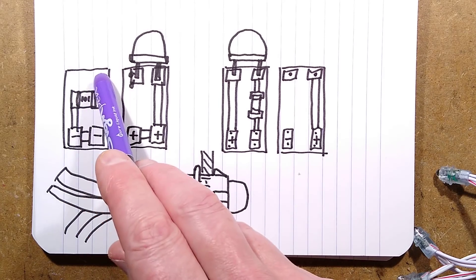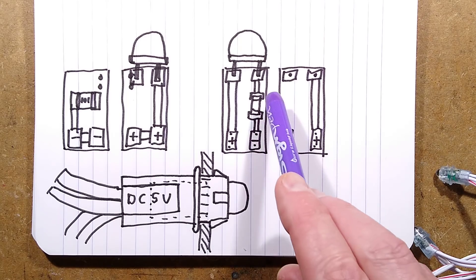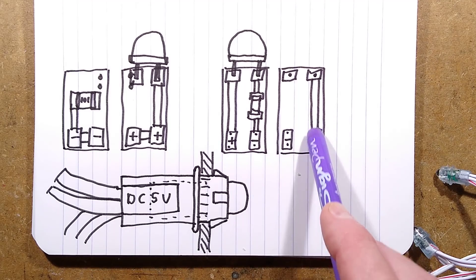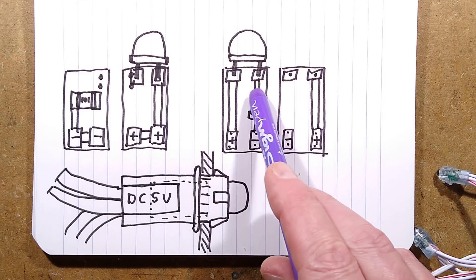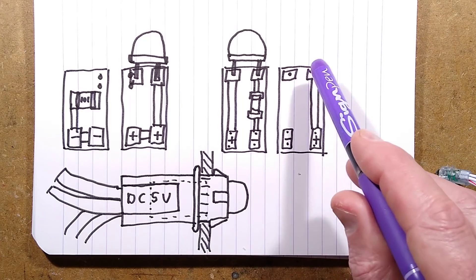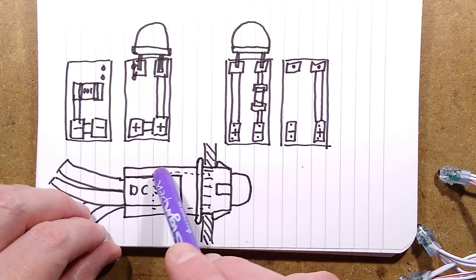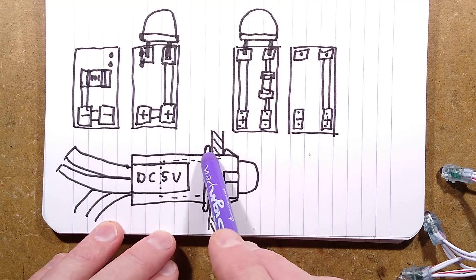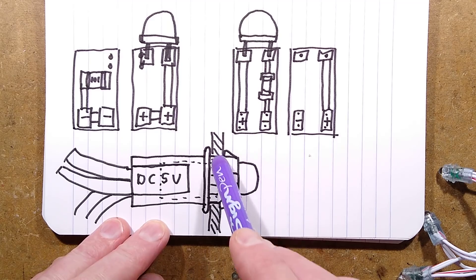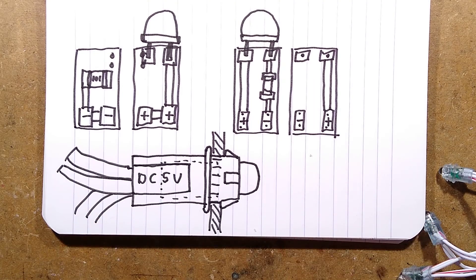The other approach has the positive on one side looped through with plated through holes, and then the resistor with one lead going straight up to the LED which is also through-hole. The surface mount resistor just breaks one of the tracks going up there. Another variant had the resistor horizontally with connections going diagonally to route via that resistor. The housing in both instances is designed to push-fit into a hole - it's a semi-flexible plastic with a rim to stop it going too far, and four wedges around it that click in as you wiggle it in. They're not bad at all if the holes are the right size.